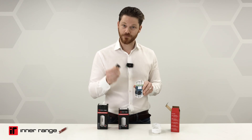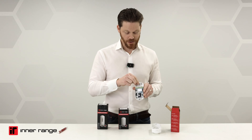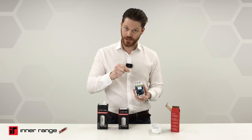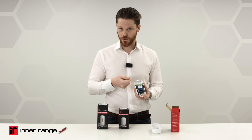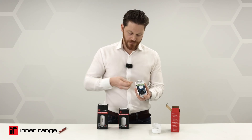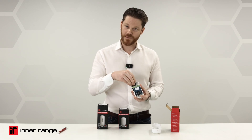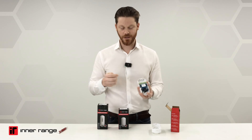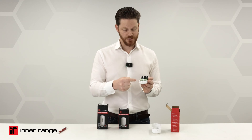There's also a piece of foam included — don't throw that away. It's used to keep out insects and bugs. At the top of the detector there are punch outs; you can simply use a screwdriver to open a punch out — no drill needed. Once you pop open that punch out, you feed the cable through, put a small hole in the middle of the foam, and wrap it tightly around the cable to stop any insects and bugs coming through and tripping the sensor. And as mentioned, wiring is just four wires.